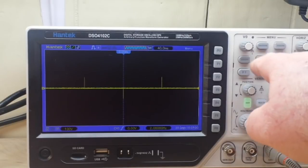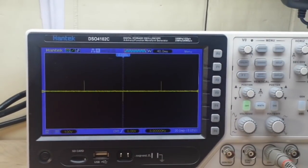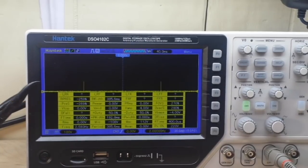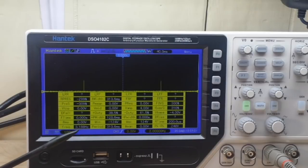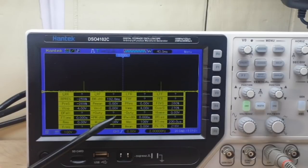If we bring up the measurement window, we're looking at a frequency of about two and a half Hertz. Now I want to see the pulse timings. Our frequency is alternating between two and a half to about 3.1 Hertz. Duty cycle is going from 61.6% down to nothing, and our positive pulse width is 192.8 — we'll call it 193 milliseconds — with a period of 385 milliseconds.